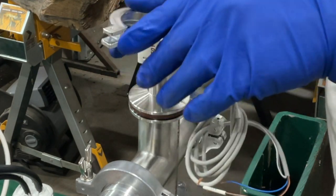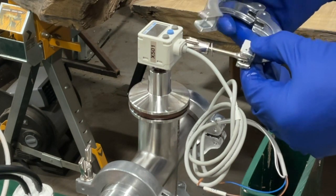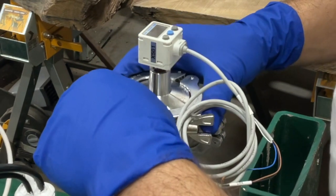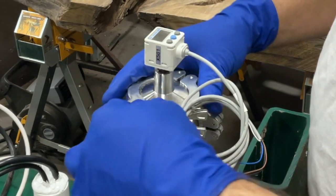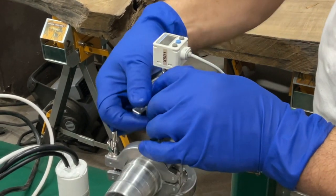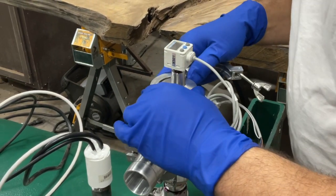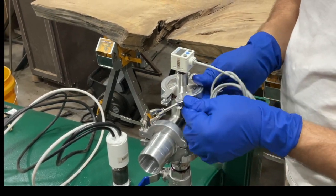What I'm really liking about these vacuum fittings is that there's no wrong orientation. If you're using threaded connections or NPT, you're always hoping that the thread bottoms out in the position you want or tightens up in the position you want — but with these, the orientation is endless. Plus they look cool. Look like something that belongs on a spaceship.